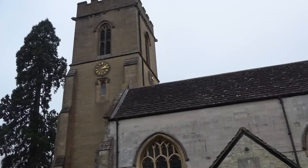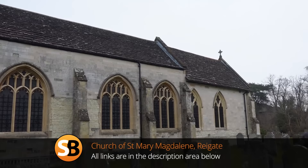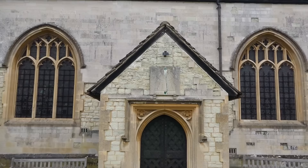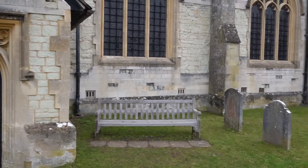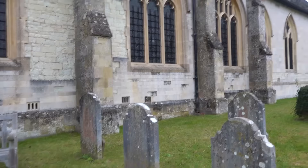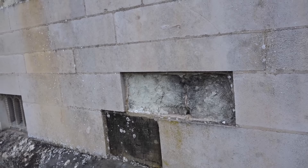The back bit, the bit you can see here which was built of that old Reigate stone, is a thousand years old - quite remarkable. I don't know whether this would have been the original stone. You can see that some of it has been replaced and even those replaced bits have actually started to decay again. That looks to me like all they've done there was a bit of rendering and lined it up. What they've done is quite a nice job of rendering it, putting lines through and actually pointing it up - unless they're bits of cladding that were actually made and stuck on there as stone slips.